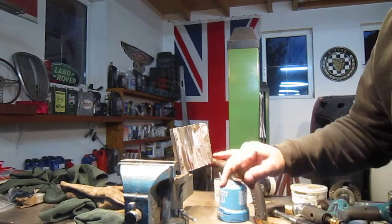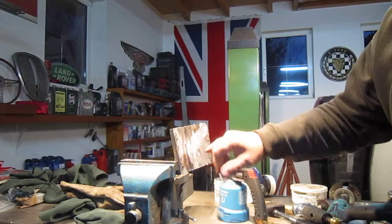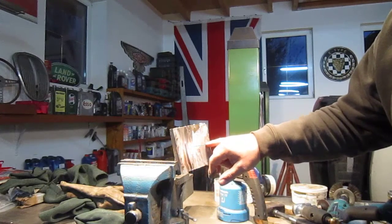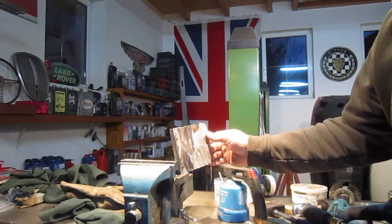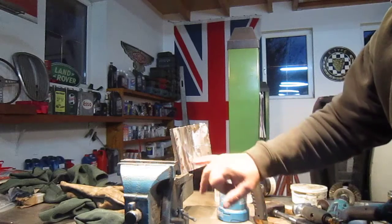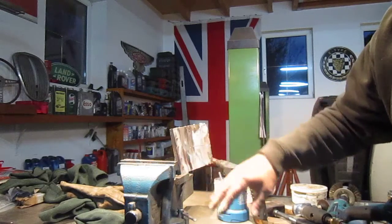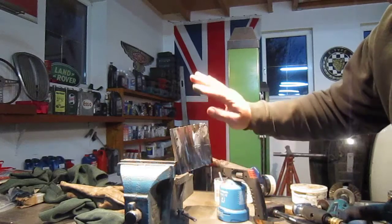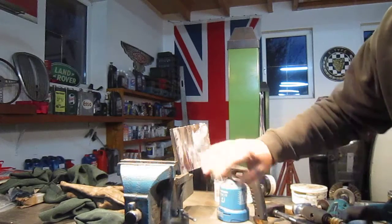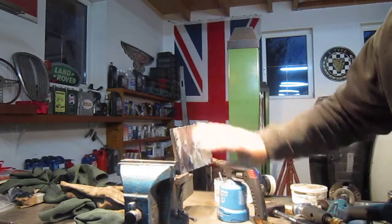So what I've done is I've actually cut this piece with a cutter, and I'll show you when I get this vertical finished how well the lead is in there. You can actually see. I won't pull it too far apart now, but I will at the end. I've already tinned this now. So I cleaned it, I tinned it, I've neutralised it with just a little bit of baking soda and water, and then dried off.